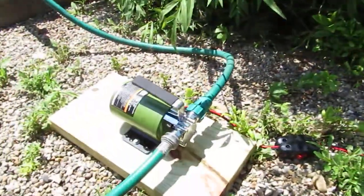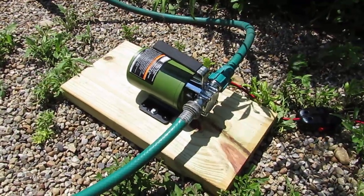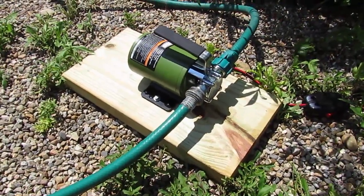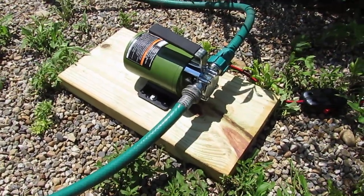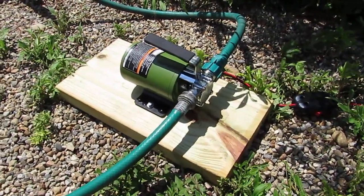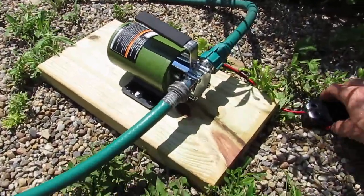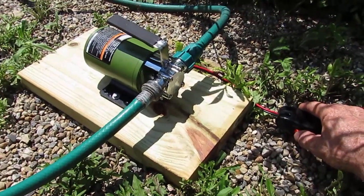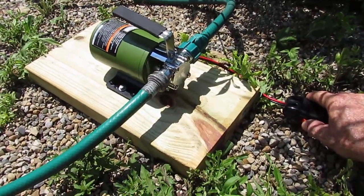The thing with this pump is it doesn't have a pressure switch — it doesn't sense when you turn on your water hose, so it doesn't switch on and off automatically. I'm going to rectify that, but just for testing I basically leave the flow open on the outlet watering hose. When I turn on the pump it's fine, but if I didn't have that open and I turned on the pump, it would probably burn up the pump in short order. So I'm going to turn it on now — it's kind of loud — then I'll back away and you'll see.